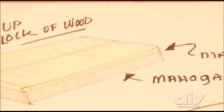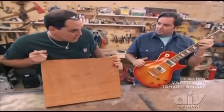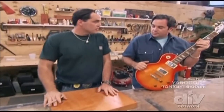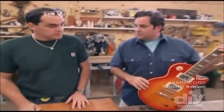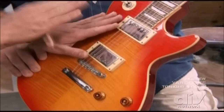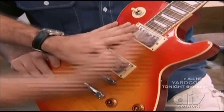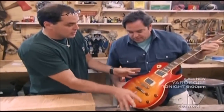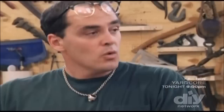We're gonna go cut the wood now and start to clamp it. All right, what kind of wood is this? This is mahogany. I got this from a supply shop that sells wood specifically for instrument makers. And that's why it's exactly that size — it's made for a standard electric guitar size body. And then curly maple, which is what the design's gonna be on. Most of these particular bodies, you can see how it's what is called bookmatched. The wood was originally one piece and they split it and open it up. So you see that line down the middle? Oh, so the grains almost match going east and west — so it gives you a mirrored pattern down the center of the guitar.